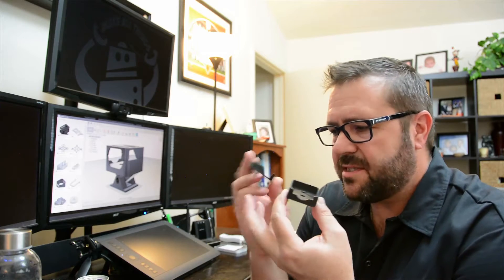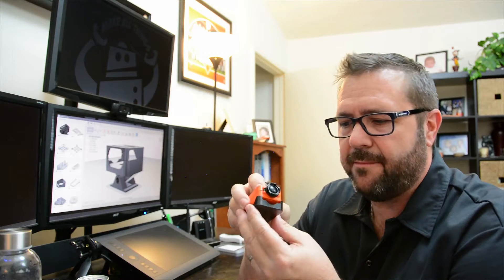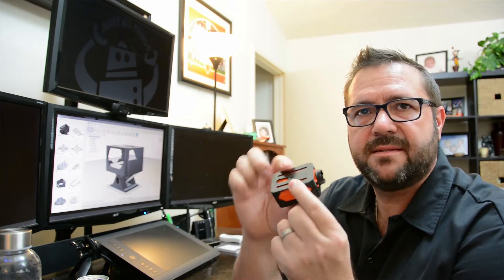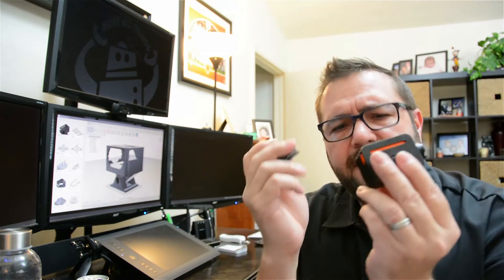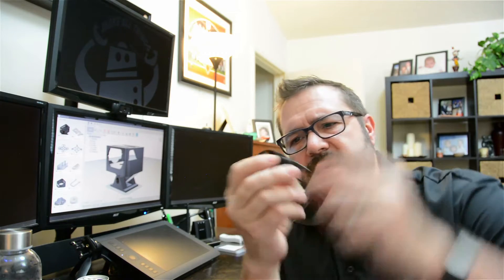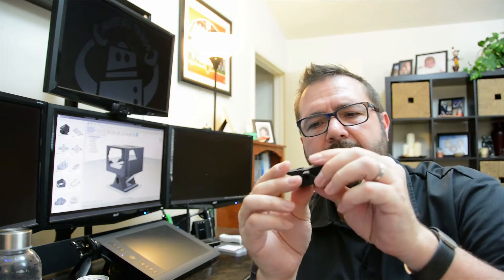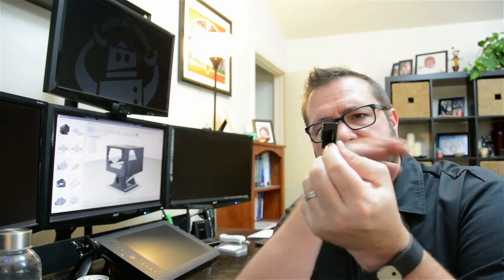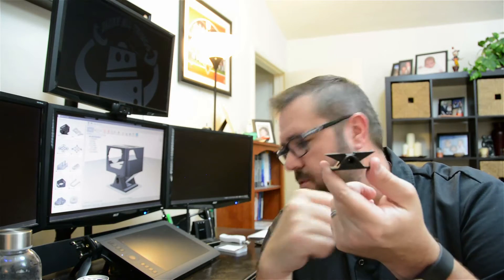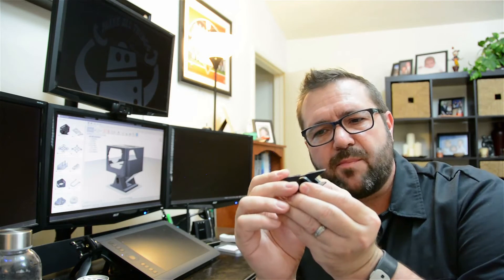These are the parts we got off the 3D printer. This is what I'd consider the top enclosure — the RunCam snaps right in there to cover the bottom part, and then there's a piece that goes on top allowing access to all the ports and buttons and protecting it. For the base, we had to separate those from the top enclosure because of how the hinge is created. To make the hinge strong so it can withstand torque, pulling back and forth, and slamming into the ground, I printed these sideways so that the layers are flat — that gives the most strength through this hole and arm. If you printed it the other way, the layers would cause the hinge to break pretty easily.